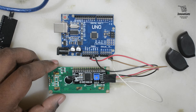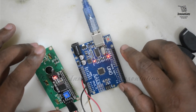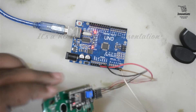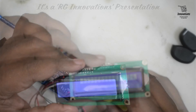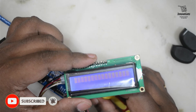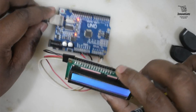Now we need to adjust the LCD's contrast. We give power to the Arduino so the LCD also powers up and connect it to the computer. Using the trim pot on the adapter, we can adjust the potentiometer and see a visible line appear. As there is no text printed yet, only the first line of the LCD is visible, but we can confirm contrast adjustment is working.